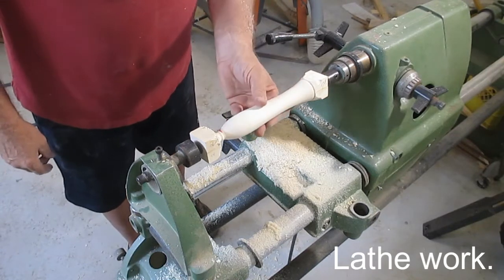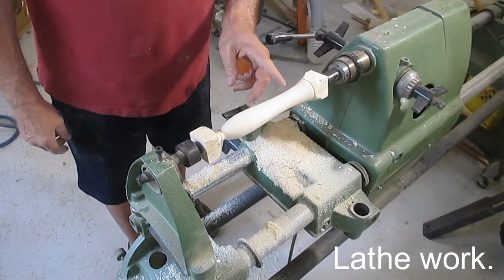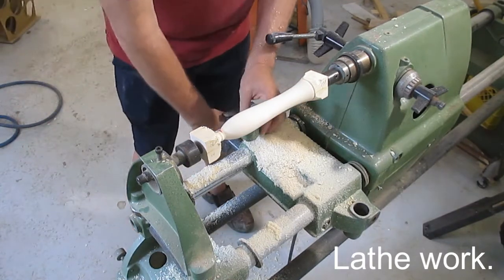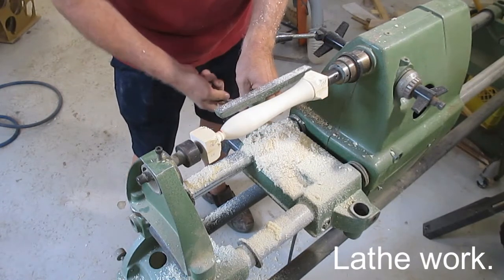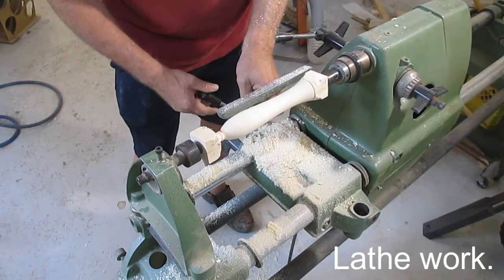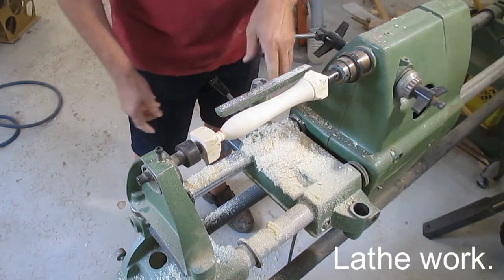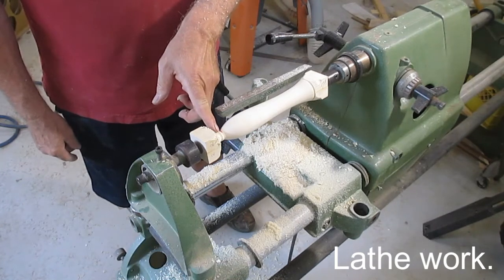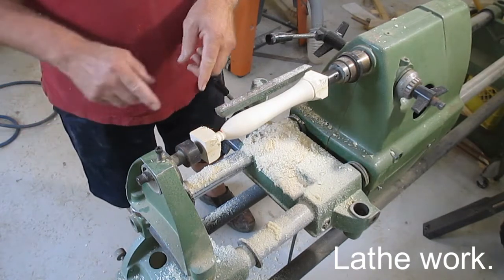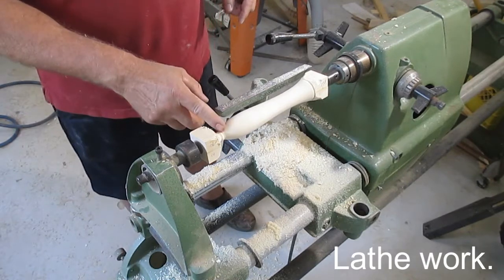After that 220 it's looking really, really great. So this thing is ready to be cut off the blank. I'm going to adjust the tool rest a little down from center because the tool rest sits a little bit high. I'm going to cut about halfway through this and then come back and work on this guy. Once I cut this off, it's very, very difficult to make things round. So I'm going to go as far down as I can make things nice and round, and maybe even sand a little bit in here.